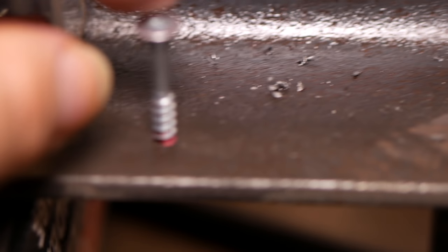When drilling the steel holes, buy a drill bit that is half a size bigger than the screw you want to use. In my case I wanted to use 6mm screws, so my drill bit is 6.5mm — and as you can see, that fit perfectly. For the wooden top part I just spaced out some holes and wasn't really precise, since it just needs to hold the tabletop and you won't see it anyway.